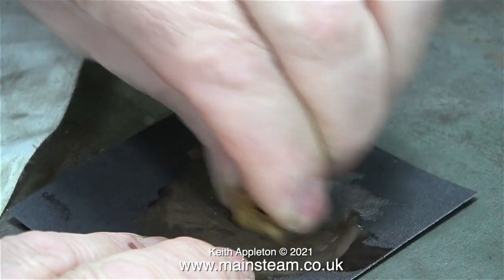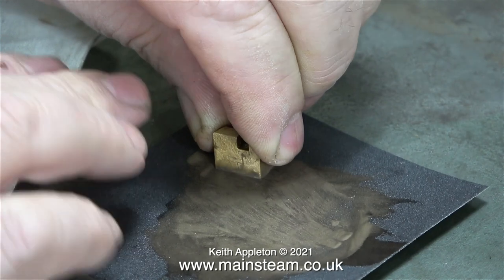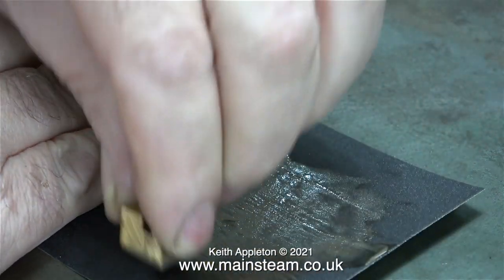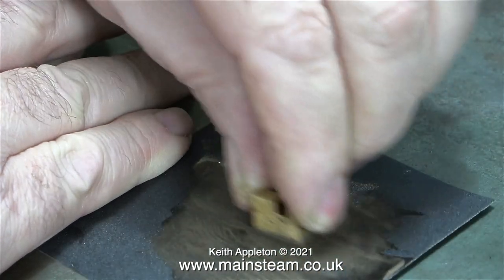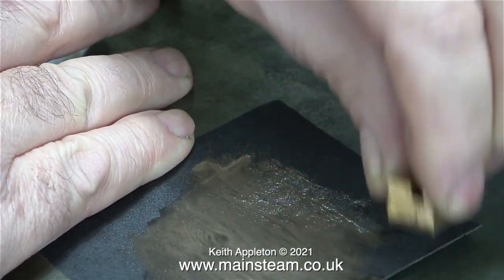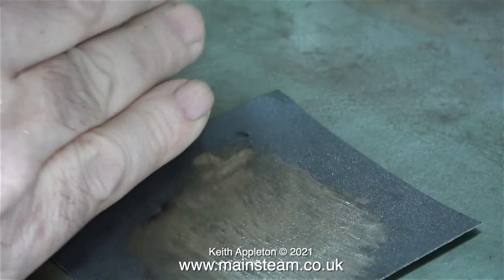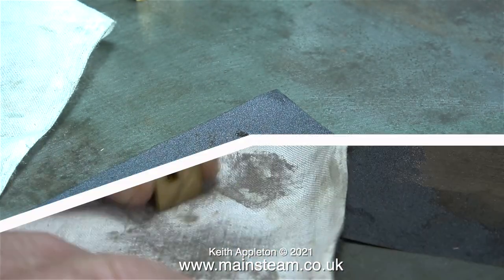Before I get a torrent of comments from experts — yes, I am aware that I could put the slide valves and the port face block into the milling machine and machine a tiny amount off both. Why didn't I do it that way? Because there's a slight risk of the parts being destroyed by accident in the milling machine. This is a safe way of doing the job if you're a beginner, and it's quite a good skill to learn. Generally speaking, I'm moving the valve in the opposite direction to the way it scored.